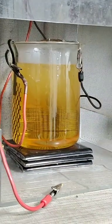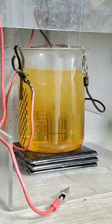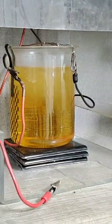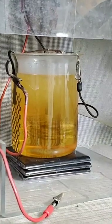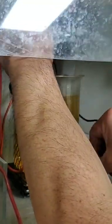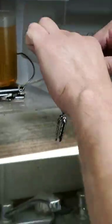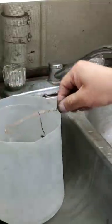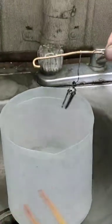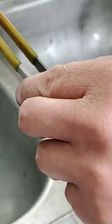And what this coating does is it's not going to let the silver get oxidized. It's forming a coating over the silver, because silver itself gets oxidized if you don't use it, if it's sitting. This way it does not get oxidized, and we chose to do black rhodium. So right now you guys are seeing the piece turn into this cool, beautiful black color.